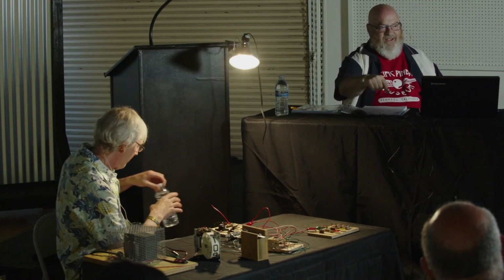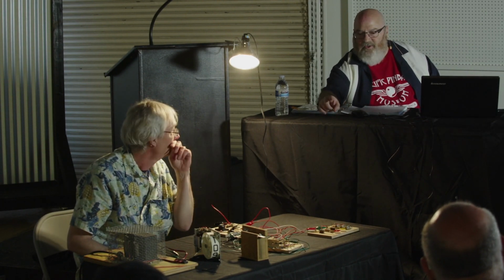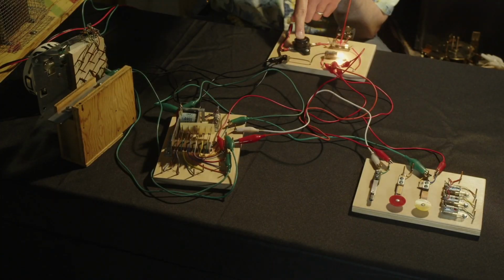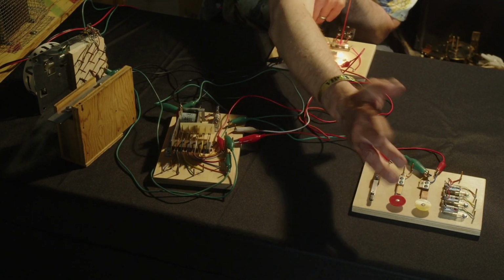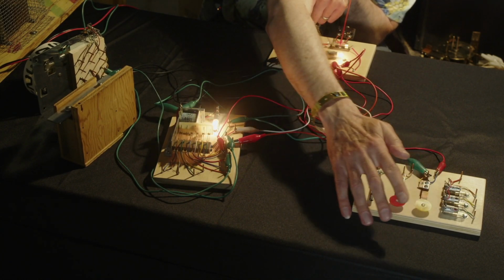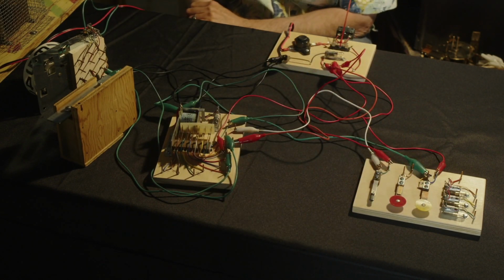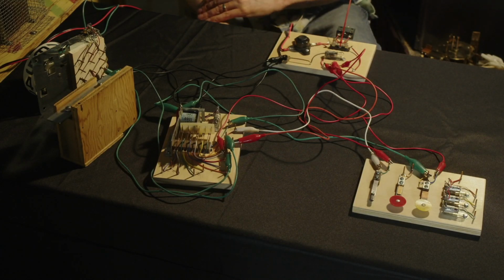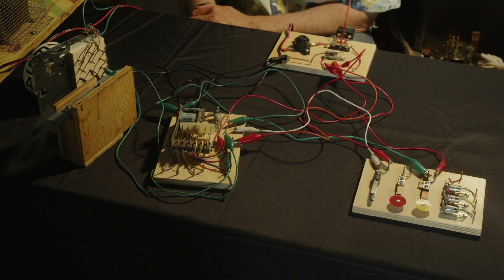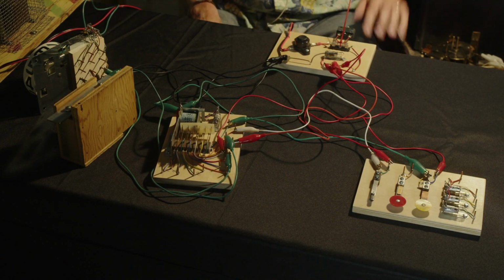We can, actually, since it's live, if you tried to have that unreliable switch, oh, okay, so now we're looking at switch adjustments to make sure the lock-in switch is the one that's going to close first. But in most cases, it's probably going to be more reliable at this point. Adjusting the switches so that the lock-in switch closes first is a little finicky, depending on how much space you've got. Mark, I've got an adjuster if you want to try. I think we're good enough.